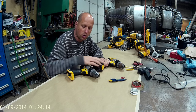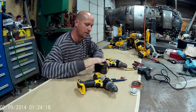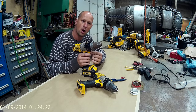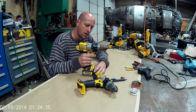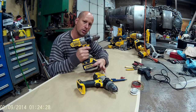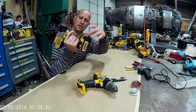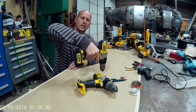Occasionally one of these 20-volt tools will start to misbehave where it almost feels like the battery is not attached. The light will blip on but you don't get any function. If you mess around with the battery a little bit, it'll come on, especially if it's operating like this — it seems like holding the battery down will make it work. And then you go to drill a hole, nothing.